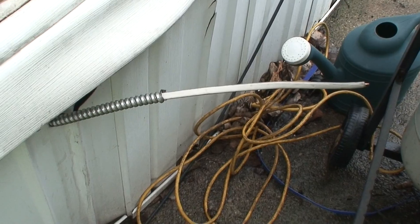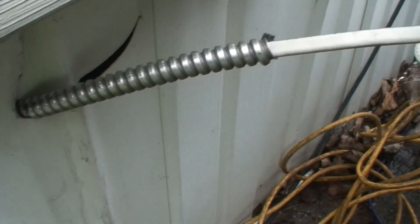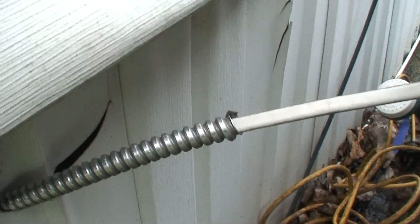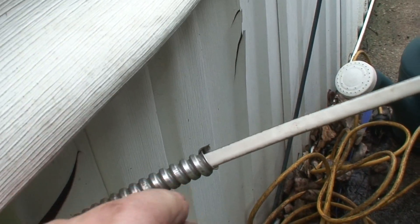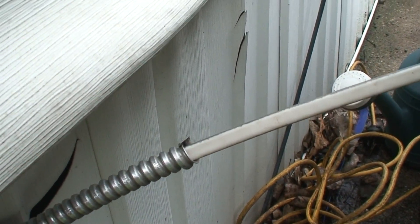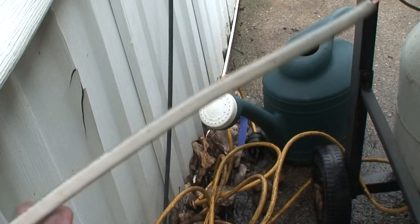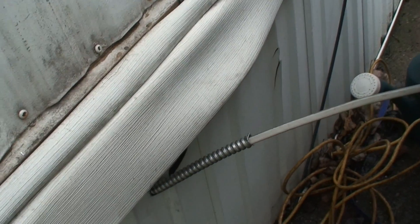Okay, the wire's run. I got part of the aluminum conduit there. Of course I have to do it the hard way — because of the size of the conduit you can only feed the wire in like a couple of inches, then you just have to start turning and turning and turning it so it screws onto the wire. So now next is to mount the box. This basically runs in conduit up to the furnace.